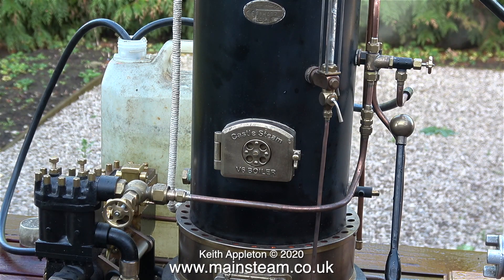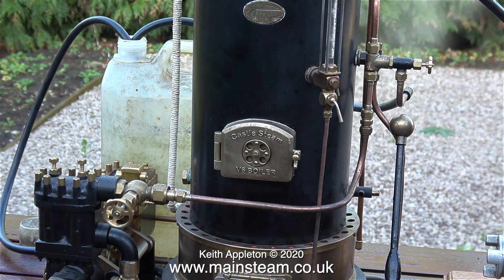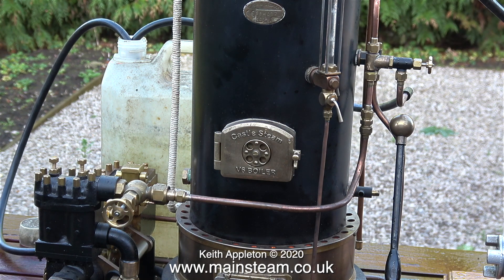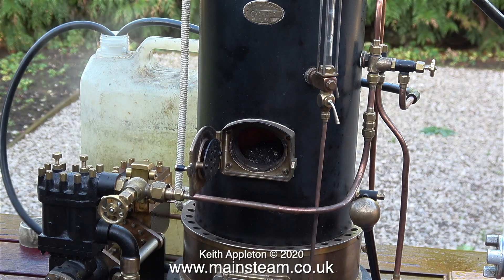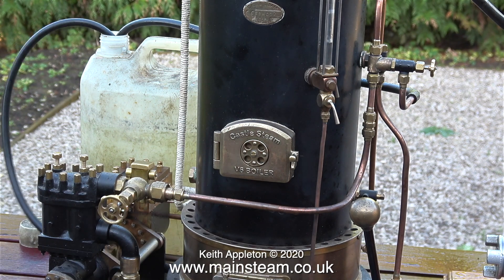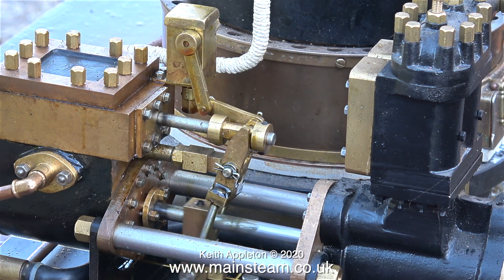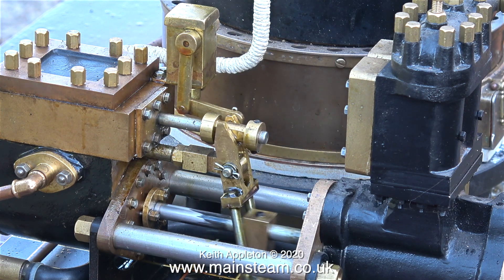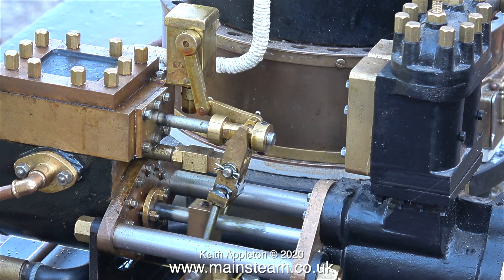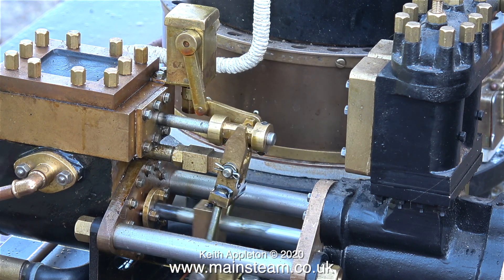In real terms the boiler can only supply about 40 pounds per square inch when the engine is running fast. Just look at the exhaust — this is not steam, it's water vapor, but look how much of it there is. Here is a universal problem that most people do not understand: with a good fire the boiler will maintain a steam pressure of about 40 psi, but this is a twin 5a which is far too big for this small boiler. Because the engine is using so much steam it's also using a lot of water, since the steam comes from evaporated water. The fire is not looking too good because I had to rush down the garden and refill my water bottle from the garden tap — I'd really overlooked the thirst for water that two two-and-a-quarter inch bore cylinders have.